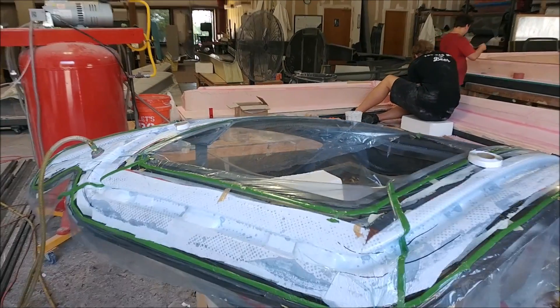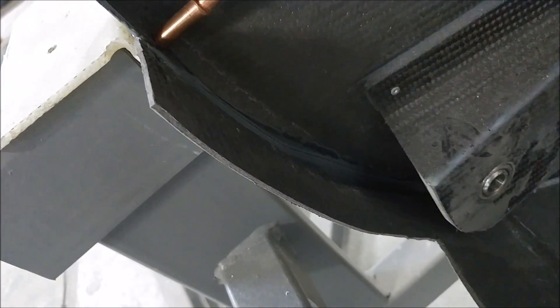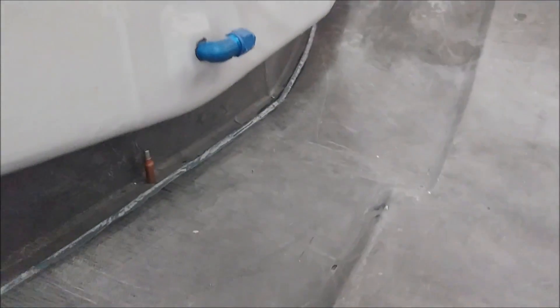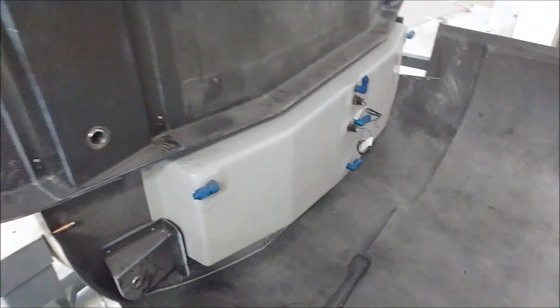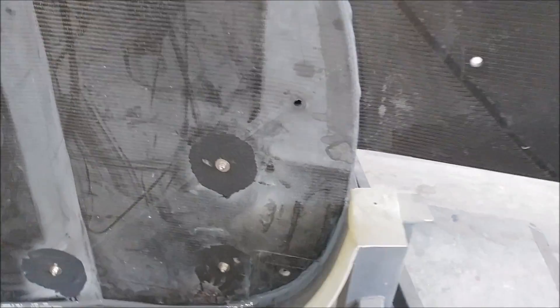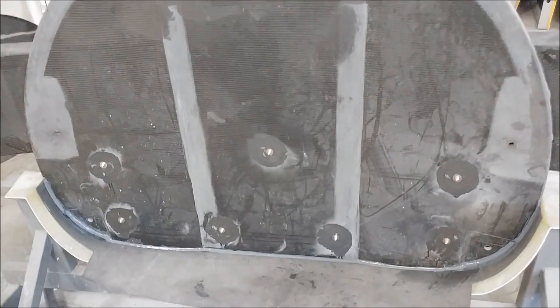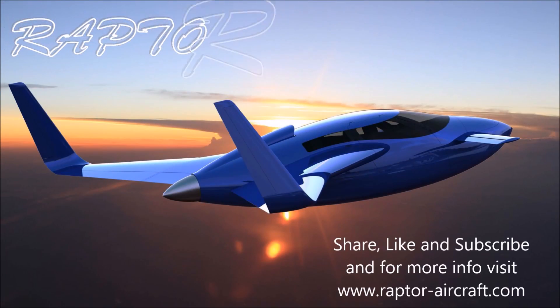All these parts are now ready to be bonded together, and that's what we'll be doing for a while. Here's the result of putting the bulkhead in place — I've taken the tape off and run a little craft stick along to smooth it all out, putting a nice small radius on the seam, same on the back side. It looks neat and tidy, it's all plumb, and we're happy with that. Next step will be the aft pressure bulkhead getting bonded in. That's our update for the first half of this week — thanks for watching.